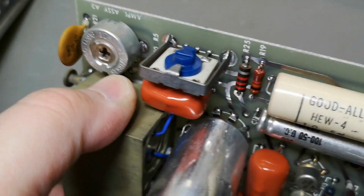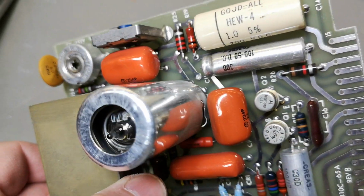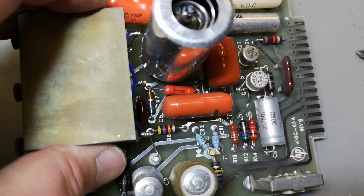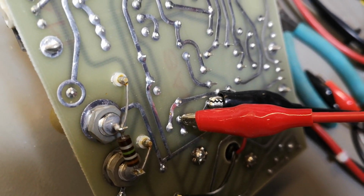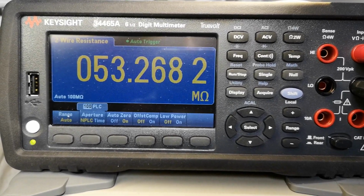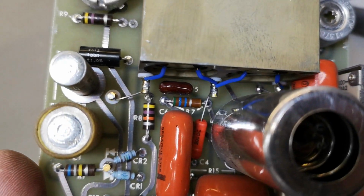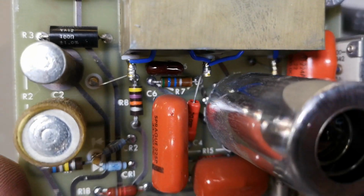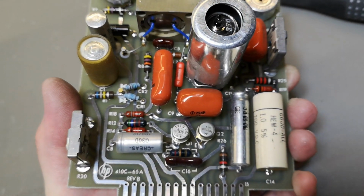Then it goes to, I'm looking for this 57 megaohm or 56 megaohm. Where the heck is that? Is that this resistor that is here? On that point here, is that the red one? How about we just measure that? Aha, I found it. And look at that. I'm actually able to measure that kind of resistance. That is crazy. So this is the input to the tube. 56 megaohm, 10%. Right. That is why you're using tubes, because then you can do crazy stuff like that.